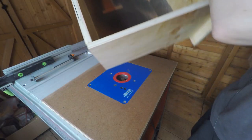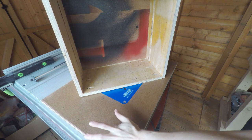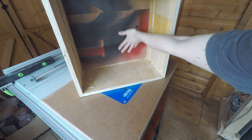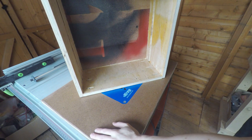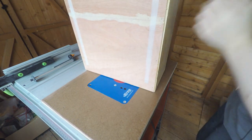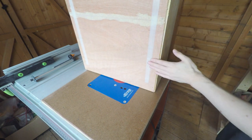I've gone ahead and made a couple of drawers out of some scrap plywood I had lying around. I've used pocket hole joinery to fix it together — my thinking is these are workshop drawers, they're not going to be seen, just used for storing bits and bobs for the router and for catching sawdust off the table, so they don't have to be very pretty. The bottom is just some spare 6mm ply I had lying around. I've added a drawer front and on the bottom I've got some slick strips — low-friction self-adhesive plastic — to help the drawer slide.